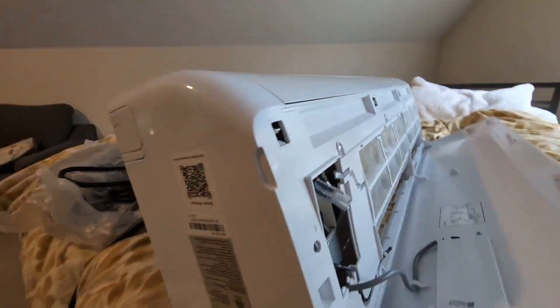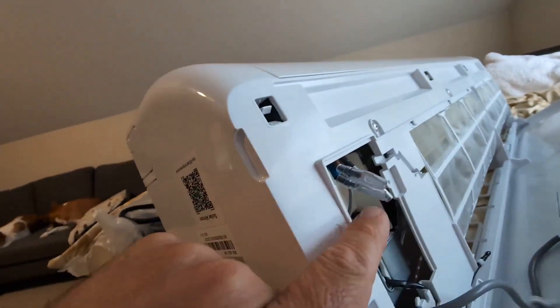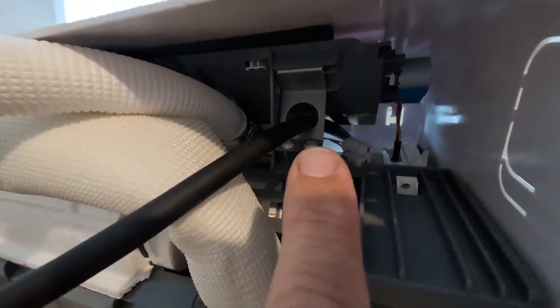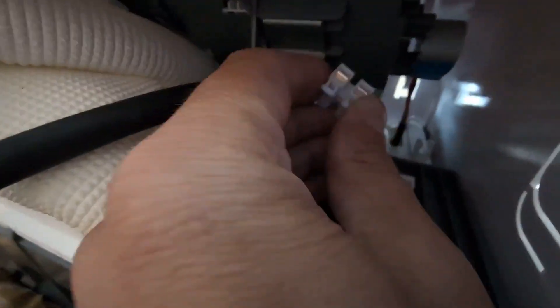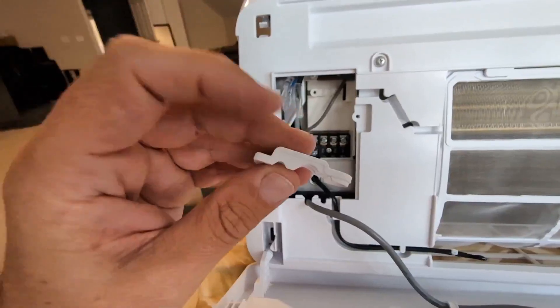On Signature Solar's installation video, the demonstrator shows it's easier to feed the wires from the top through the back. I personally found it just as easy to go from the bottom, and I'd recommend the bottom so you can route it through the interior loop made specifically so the wire doesn't press against other things while it's inside. That is the guide for the wire itself — this is the electrical and communication cable. There is an unknown mystery plug here with just two pins, not connected to anything, that isn't described in the manual or installation video.